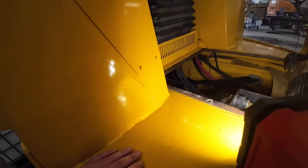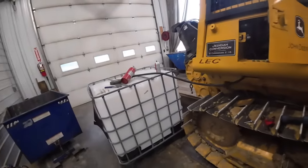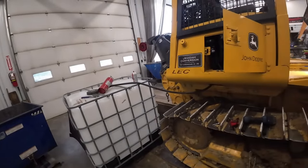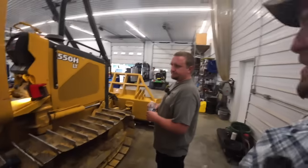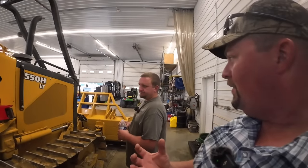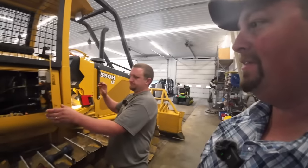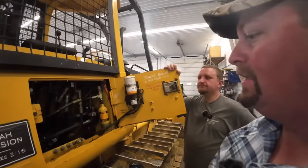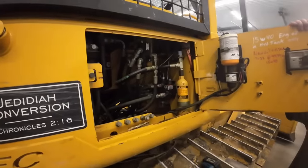Anyway, we're going to get that hose popped out of there and take a peek at it. We did drain the oil out of it yesterday because we knew what we were going to be doing. We do have to pull that hydraulic pump off. We'll have to pull a vacuum on that transmission tank, because when we pull that pump off the transmission pump, there's oil that spews out about the size of your little pinky finger. But cross your fingers, it's just that line, and we'd be done today.